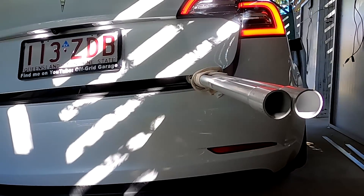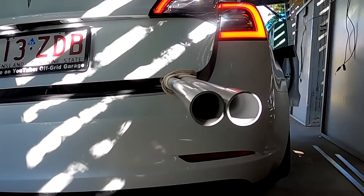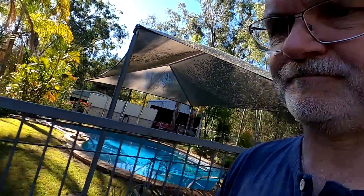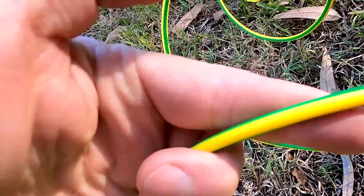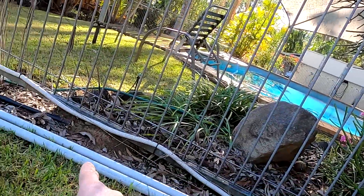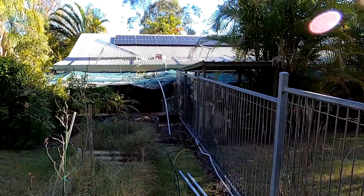I forgot the pipe cutter. Okay, I want to show you what happened — we've got a bit of a traffic jam here with the 25mm conduit. I should have known before that this wasn't going to work. I tried in the garage with an offcut and four solar cables and it just fit, but I didn't think about the earth cable which is a 4mm cable — fairly thick. All five cables together don't fit. We now have 32mm conduit and we have to replace this whole section — put all the cables back in the new one and we should be good to go.